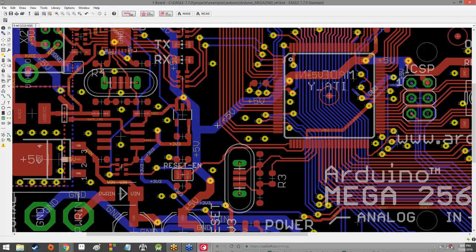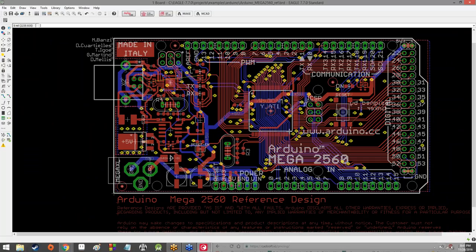Imagine you were building this in three dimensions, and the blue represented the bottom of the board, and the red represented the top of the board. You can have the blue and the red cross one another because they're actually not crossing. They're just passing over and under one another in the Z-axis. But within the same layer, things cannot cross one another unless they are intended to be connected to one another. So that's where stuff like this can make for a pretty interesting kind of puzzle. You've got to find a way to lay everything down onto the board so everything that needs to be connected is connected, but nothing's crossing that should not be crossing. So nothing is connected that isn't supposed to be connected. And that in and of itself can pose a pretty interesting challenge.